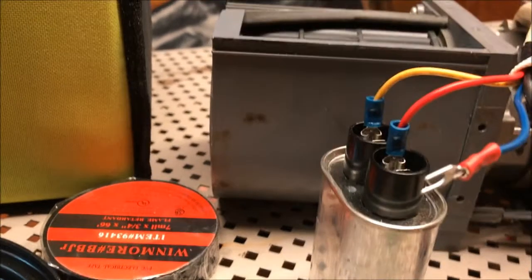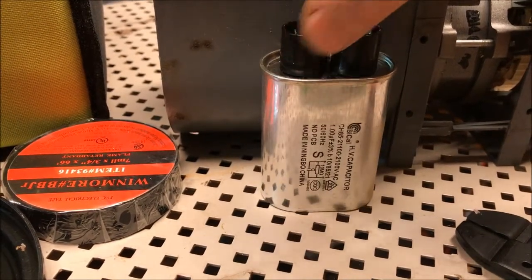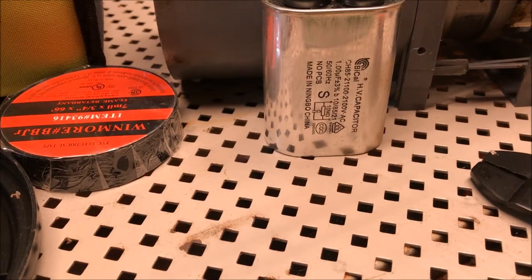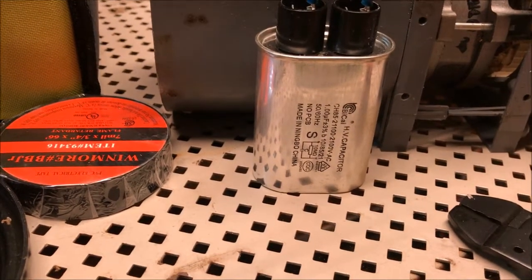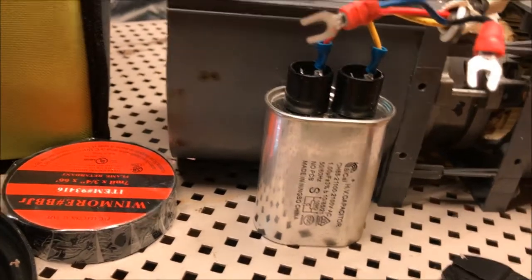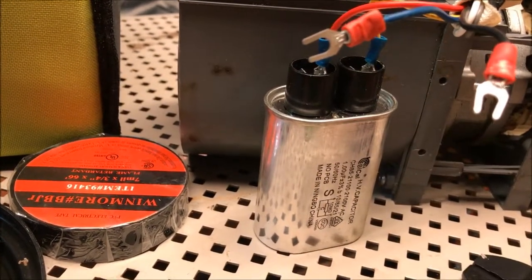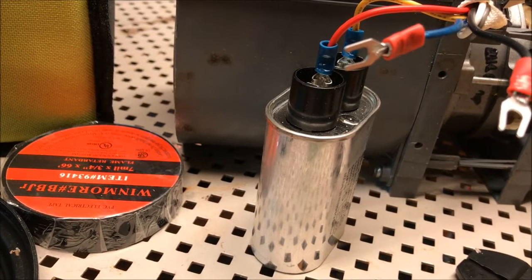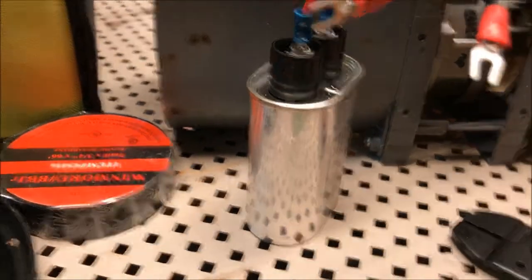Now, a capacitor — you want to make sure it's discharged before you mess with it. I'm not an electrical engineer, I'm a communications engineer. One of the schematics I read said 4,000 volts — it can carry 4,000 volts. You don't want that hitting you; it'll bite hard and it can kill you. Once you power this, you don't want to touch either terminal. Unplug it from power and touch it to ground without touching it yourself. Google or YouTube how to discharge a capacitor.